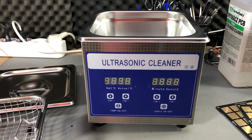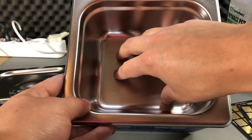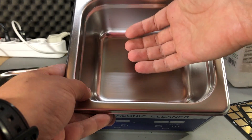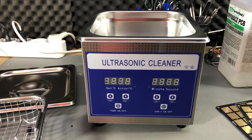You can also use this for cleaning jewelry and other small parts. The working principle is that an ultrasonic transducer is coupled to the bottom of the unit — in this case a 60-watt transducer driven at a resonant frequency of around 40kHz. The resulting waveforms agitate the cleaning liquid, producing so-called cavitation bubbles. This agitation creates high forces on contaminants stuck to objects and can penetrate blind holes, cracks, and recesses hard to reach by manual cleaning. Ultrasonic cleaners also have a built-in heater — here rated at 100 watts — to further enhance cleaning action.